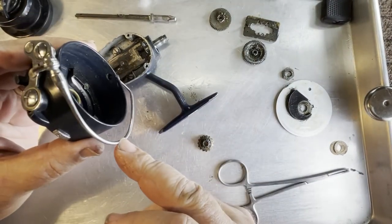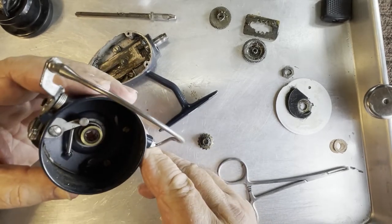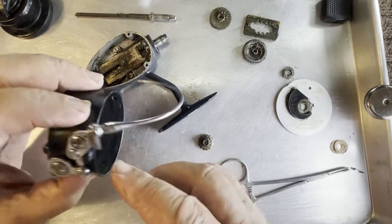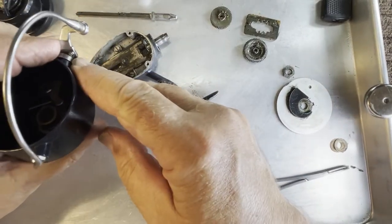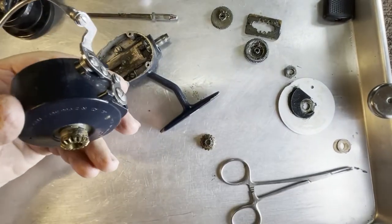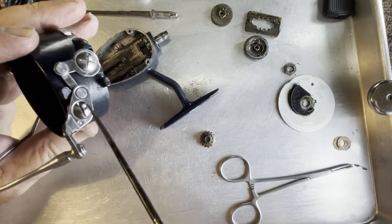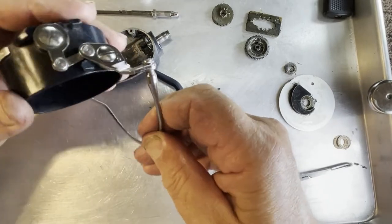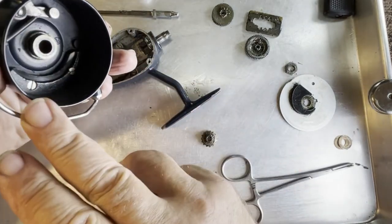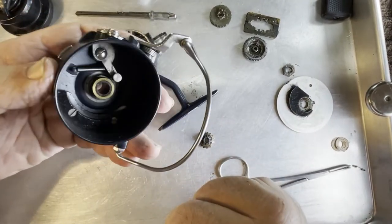Once it flips, it's not coming back unless this arm inside here trips it over. Once that's happened, the only way to trip it back is to push down on the bail, which lifts these arms up over here and pops it free. I don't have a great desire to take this apart beyond that, but we have a spring action right here — this spring is looped over a little eyelet here. The other side goes in right there. I'll spend a few minutes looking at it to make sure I understand it properly before I take it apart.